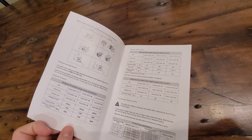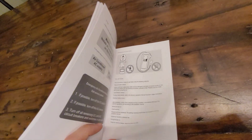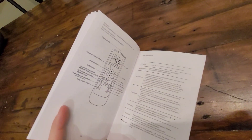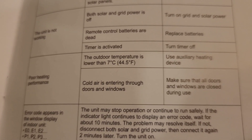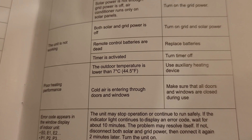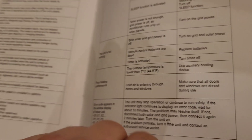The other thing I wasn't a huge fan of: this is the only paperwork you get with the unit — the only documentation. There are no coefficient of performance charts, no heating season performance factor, not a lot of information on the heating side whatsoever. There are some brief install instructions and charging information if you're adding length to the line set, but it could have been a little more detailed. The only bit of information on heating performance just says you can expect poor heating performance when the outdoor temperature is below 7°C. So I really wasn't sure if this was going to heat adequately in cooler temperatures, but so far it's been great.